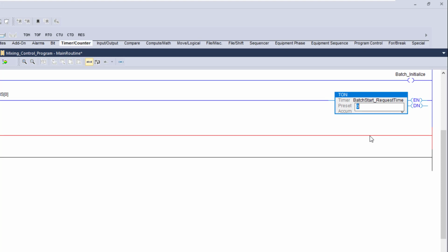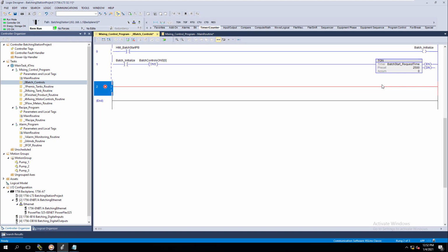they operate in thousandths. So if you think about 1000 would be 1 second, 2000 would be 2 seconds, and if I wanted to, 2500 would be 2.5 seconds. Now if I shorten that up, this would be 1/4 of a second, and this would be down in the milliseconds. So they are in the thousandths. So when you do a timer, just note that it is in thousandths. So if you want 1 second, it equals 1,000, right? So it's really simple as far as keeping that in mind. So just to make sure you're well aware of that.